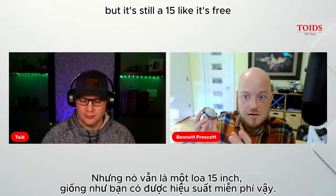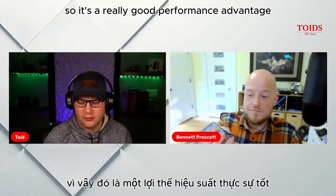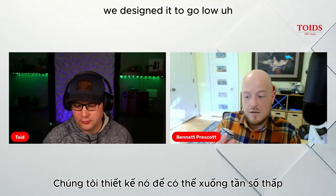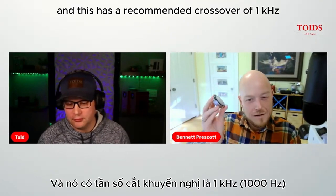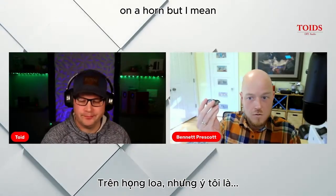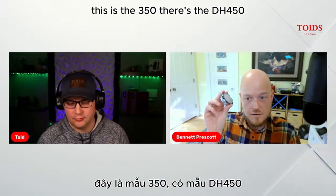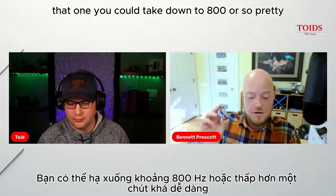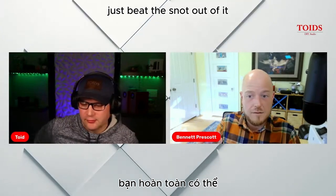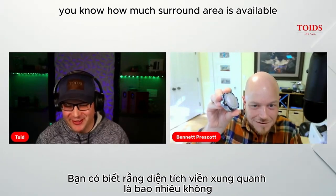The compromise isn't the low end. We designed it to go low. This has a recommended crossover of one kilohertz, and the AES power rating is with a second-order high pass at one kilohertz on a horn. If you don't need maximum output, you could go a little lower. The bigger version, the DH450, you could take down to 800 Hz pretty safely.